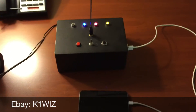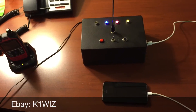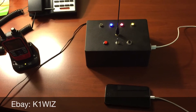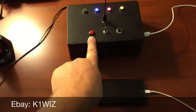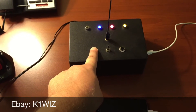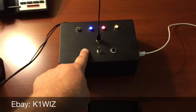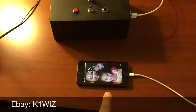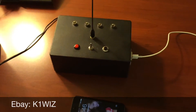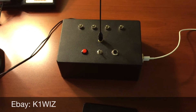One of the things I've heard often from hams that run mobile DSTAR hotspots is that they've had unclean shutdowns when they've arrived at their destination, and it's resulted in card corruption. To address that, I've built in a red shutdown button. When we hold that in for five seconds, it fires off a command — S-bin shutdown. When the system is shut down cleanly, you'll notice it releases the tethering connection, and now all of the LED indicators have gone dark. This indicates that the hotspot is now okay to be powered down. So we disconnect power and we're ready to go.